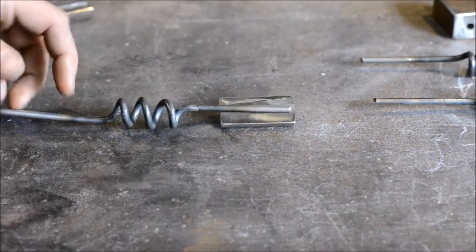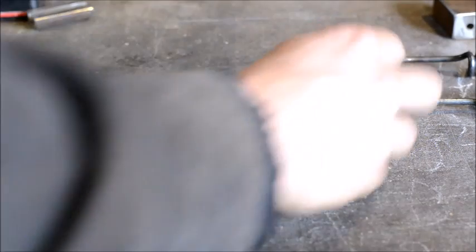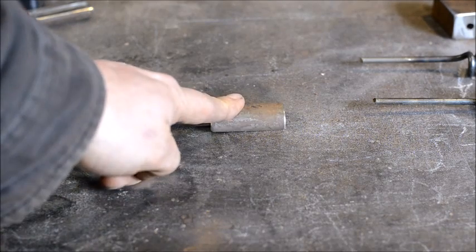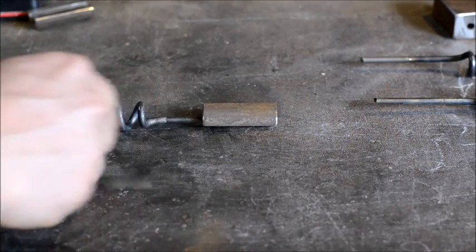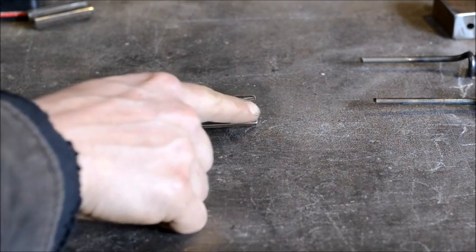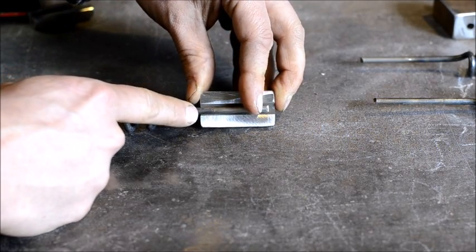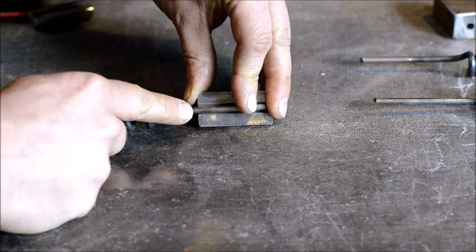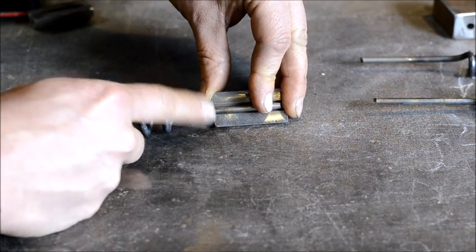On this particular one, this is going to become a top tool for like a fuller ring die. This is also another way of making a flatter — if you flip it the other way, you can use it to flatten out the stock, take out the chop marks from power hammer work or from the dies themselves. That will allow us to get a good amount of weld up both sides without weakening it by welding right in the critical area. The only way to keep from making a weak joint there is by building up weld, and that just makes it a mess.